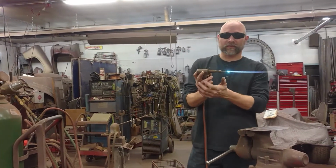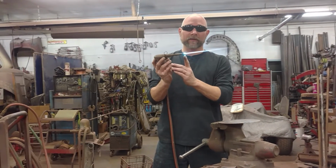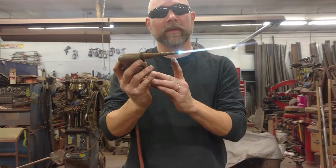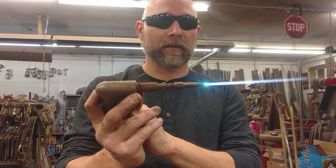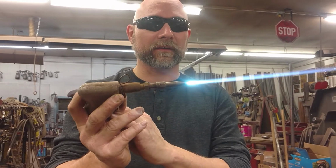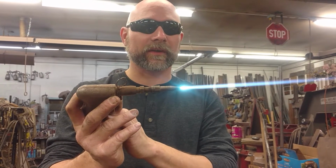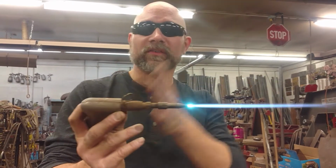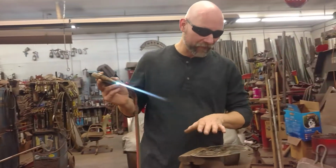When you adjust this flame, I'm not sure if the camera can see it, it probably can't, but the inner cone, we adjust it with 1x, 2x, and 3x, meaning if I'm going to adjust it one size, I'm going to take the acetylene feather, and it's going to lengthen the same length as the inner cone, and then I'm going to open oxygen to compensate. That's one size, or like one step on another welding machine.